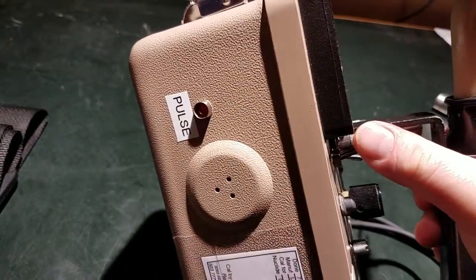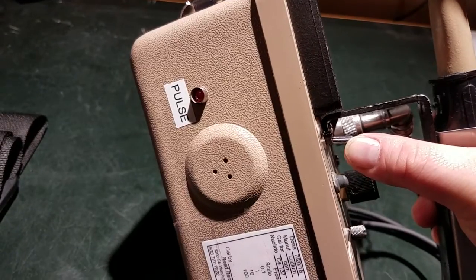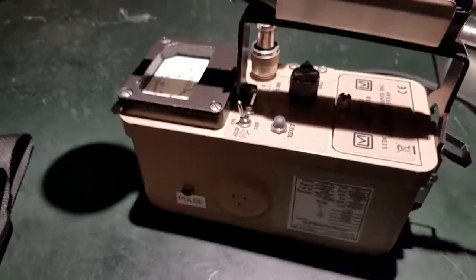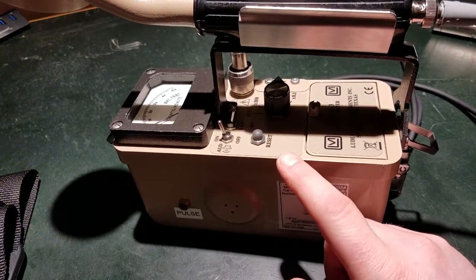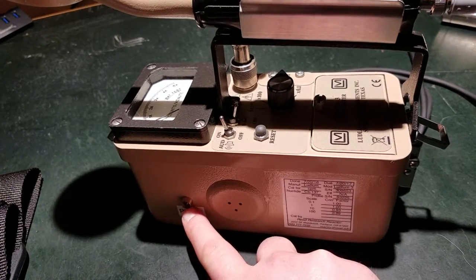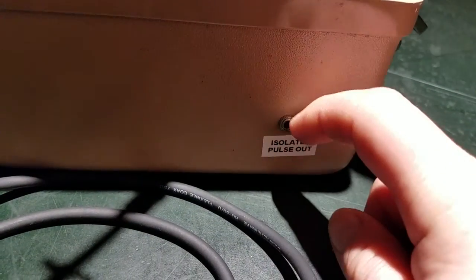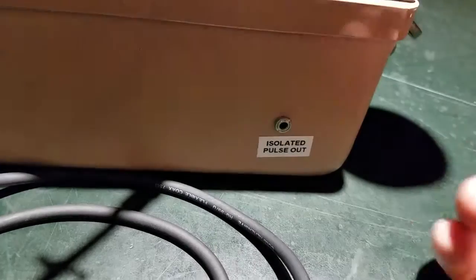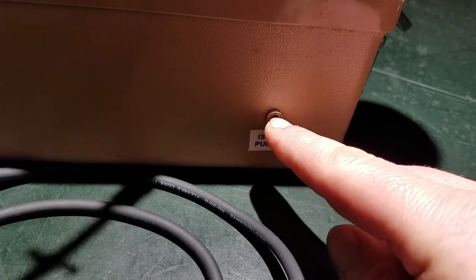My mod is unique compared to a lot of other pulse LED mods, because in many other mods when you turn the audio off, the pulse LED doesn't work — it's attached directly to the buzzer. In my case, I found an unpopulated header on the back of the circuit board and soldered a header onto it. One of the signals it provides is a pulse out signal. I hooked that up to a 555 timer that stretches the pulse long enough for the LED to blink, and it also connects to an opto isolator, so the Ludlum circuitry isn't directly electrically connected to whatever is measuring the pulses on the other side.